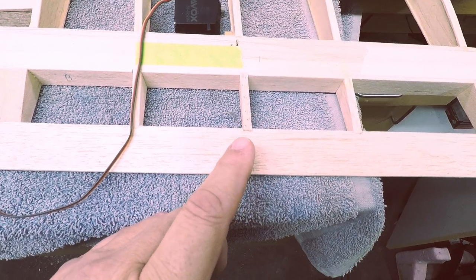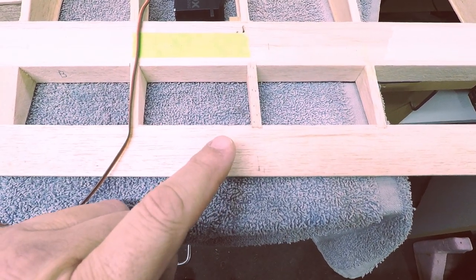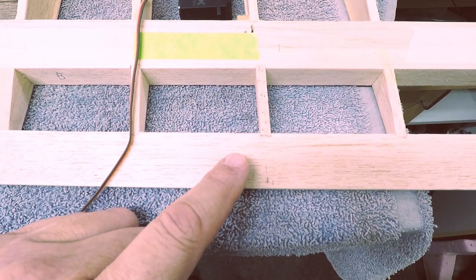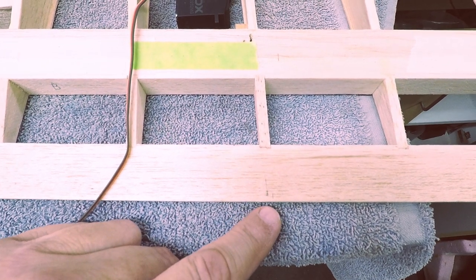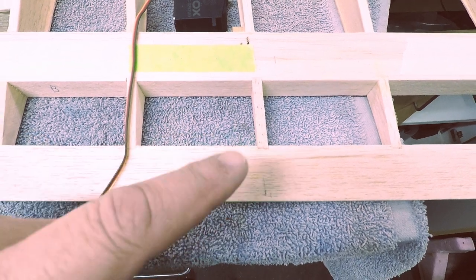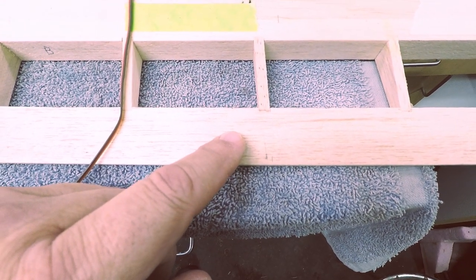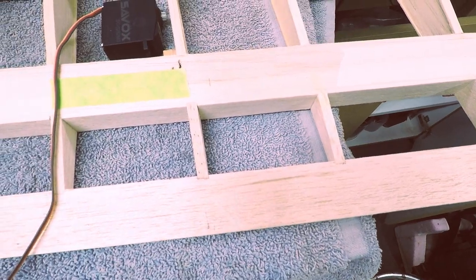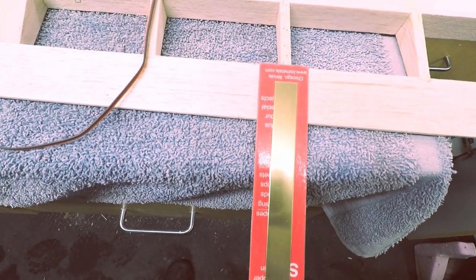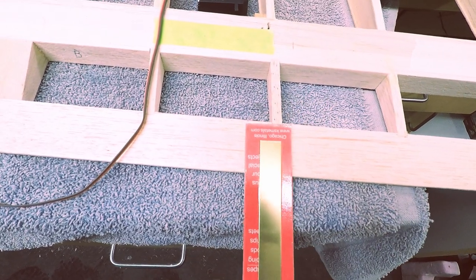Now, control horns — I searched control horns the best I could for what I was looking for, couldn't find really what I was looking for. So what I'm probably going to do — I've got some RC aileron control horns that I think would work very nicely. I can shave them down to whatever dimensions I want, and then it's just going to have two screws set up diagonally to go through the wood. That will work out okay. The problem is I don't know how much I want to trust this balsa for the torque and the pressure that's going to be putting on the trailing edge. So in my madness, I'm probably going to come in and band it — just come down to here and then loop this underneath — so it's going to be a piece. I'll set up a jig and bend it so that it can sit here, run the holes through here, so I'm transferring the load mostly to this with less chance of breakage.